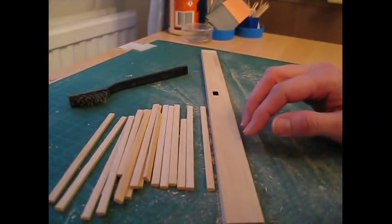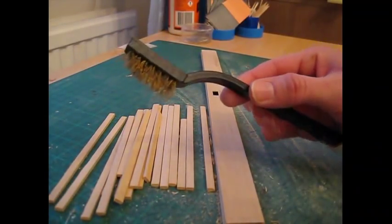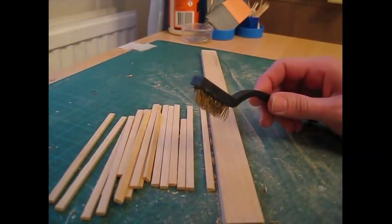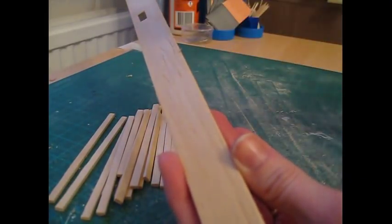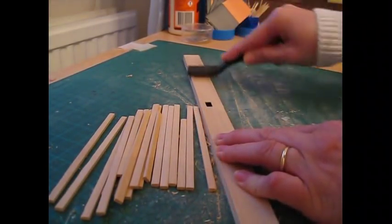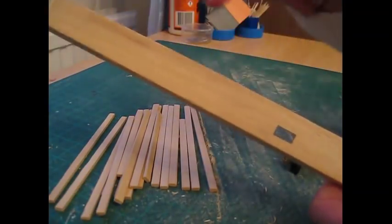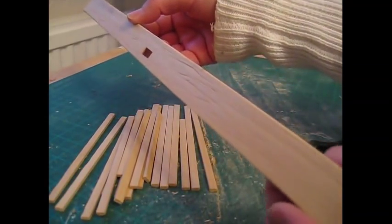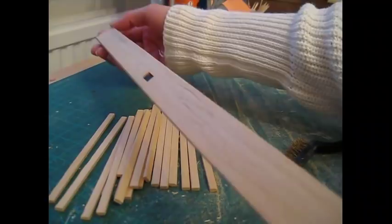Each piece has now been roughly sanded and I just want to finish them off with this wire brush. I've got a set of these brushes and this is the harshest one in the set — what it does is create a grain in the wood. I'll show you the technique: I go along in circular motions and then drag the brush back along the wood, and you can see that creates some really nice patterns which will look like grain. I'm now going to do that on each piece and then they'll be ready for finishing.